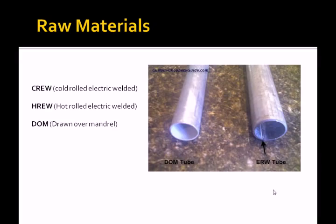You should be able to carry the frame reasonably easily when you finish, because it should weigh about 40 to even 100 pounds. Cold-rolled electric resistance welded steel, CREW, as it's called, is the standard choice, but there are other materials you could use. Chrome Moly is an option for the tubing, but it is more expensive, probably unnecessarily so.